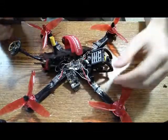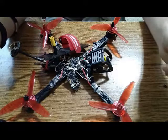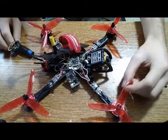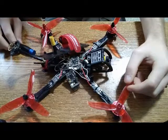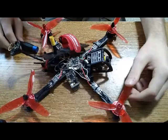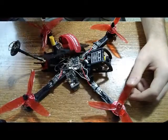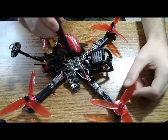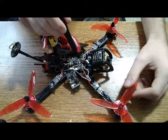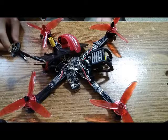On the bottom you're just soldering in the power cable. That is the flight controller. I really like the CL Racing F4S — it's about $50 on Amazon — and the fact that it's the PDB, OSD, and all that makes it very valuable. One thing to make sure: measure the cables from your ESC to the flight controller well. I made a mistake switching flight controllers where the ground had to reach way over to one side and the power all the way to the other — they were a little short and I had to do some awkward soldering.